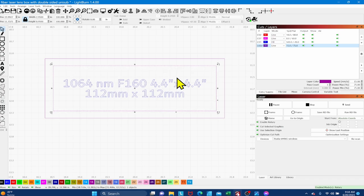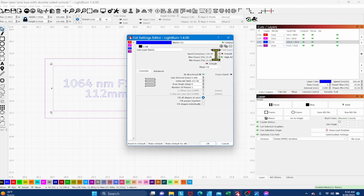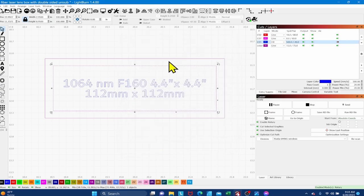I kept the font simple. I'll start engraving at 500 mm/sec at 20% power with high air off — when engraving two-color sign plastic, you want very little airflow to avoid blowing the red into the white and creating a pink hue. The yellow frame cut section is straightforward, but the red-to-white engraving will be trickier. Let's head to the laser and check it out.